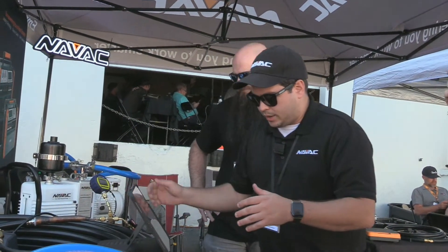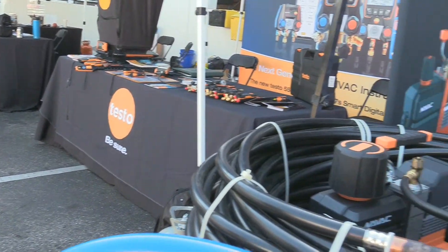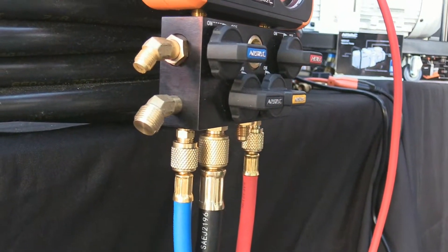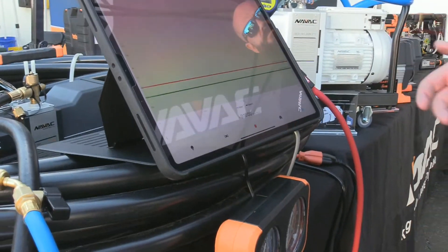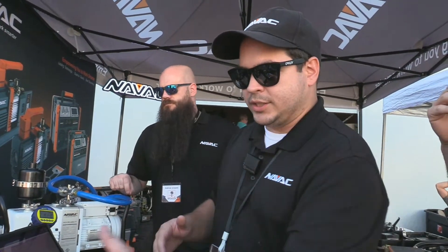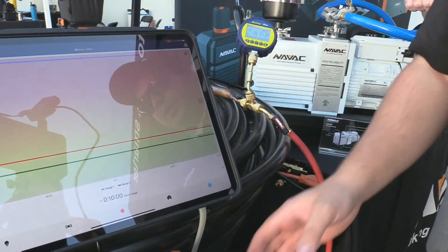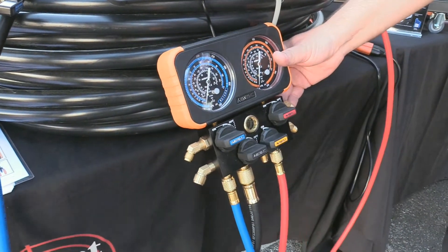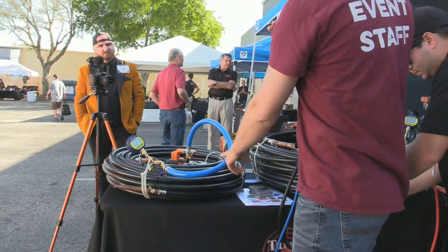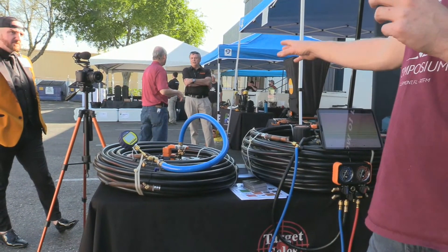On the 12 CFM over here, we are mimicking what most technicians do: hook your vacuum pump through a manifold through your low and your high side hoses. This one actually has the core still in it. Unfortunately on this one we had to remove it just so we could add the micron gauge and get a reading, because you're never going to get a good accurate reading on a micron gauge on an analog manifold. So what you have here is best practice — tiny 2 CFM pump — versus a practice you see a lot, using a giant industrial 12 CFM. We're going to race and see if best practices actually really work.